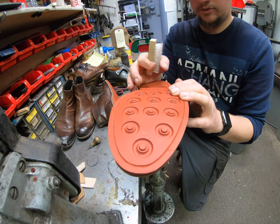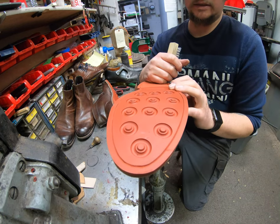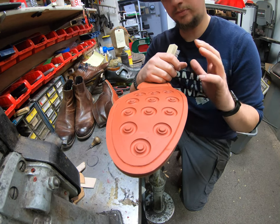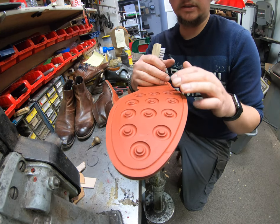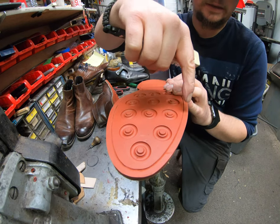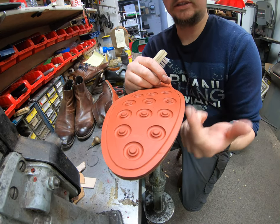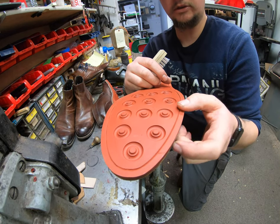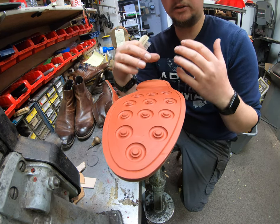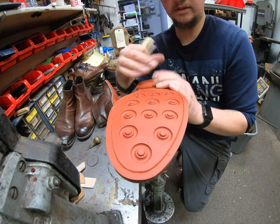There is another version, which I did on a pair of Allen Edmonds for a gentleman, called closed channel stitch, which, when it comes to rubber, is probably the hardest to do. Mainly because in a closed channel, our stitching machine has this little blade that comes down and cuts the channel open so it's nice and thin while the machine is stitching right after that cut goes. Getting all three of those to line up is difficult in itself, but the other challenge is rubber stretches.